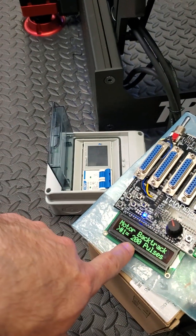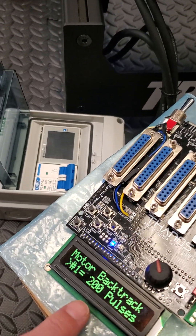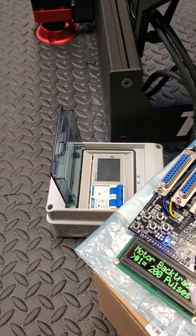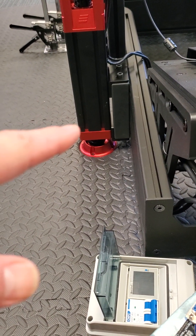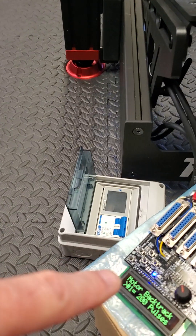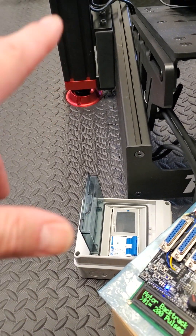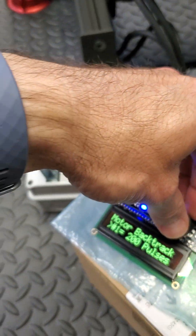The default value I was using for a long time was hard-coded at 200 pulses. That was because of the multiple lead screw types — there is different travel that may have to happen. So 200 pulses may not be enough depending on the lead screw, the type of motor, or the stroke. I made it adjustable now.